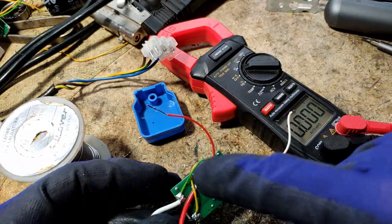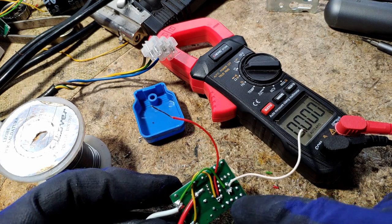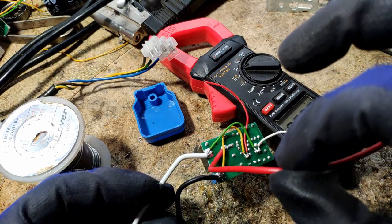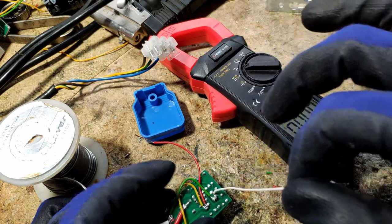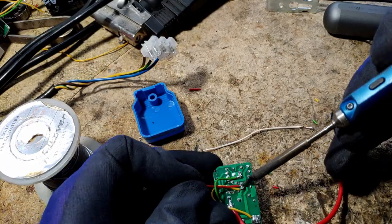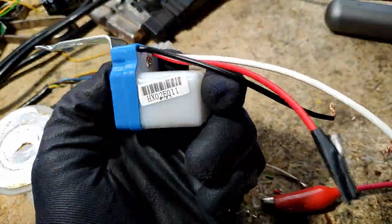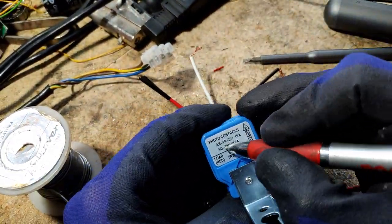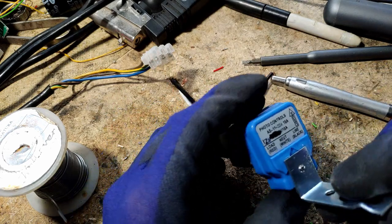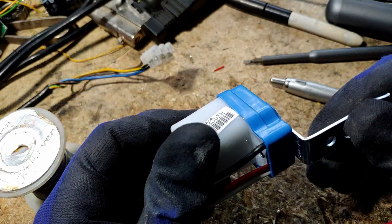Obviously, now I will have to change these wires with larger ones — or rather, no I don't. Because the small wires will bring what's needed for the relay to work, but the load itself will still be carried only by these larger input wires. So it's fine like this — I just need to remove these ones, and the 12 volt light switch is ready. Yay! This is all, guys. I'm happy if it was useful for you. Now you know, if you've got 220 volt light switches around, you can convert them to 12 volt projects. Have fun!